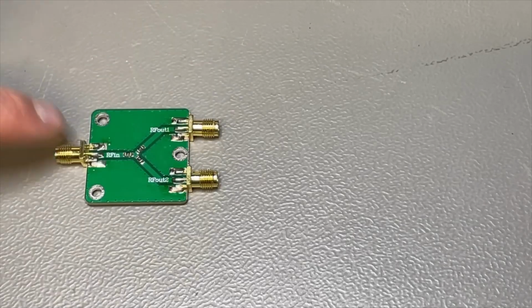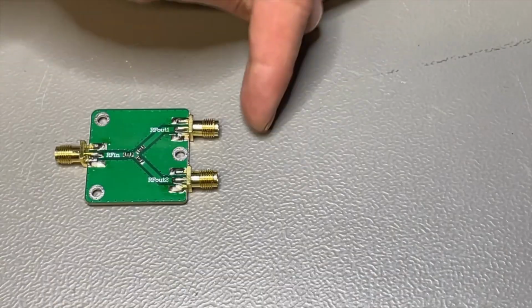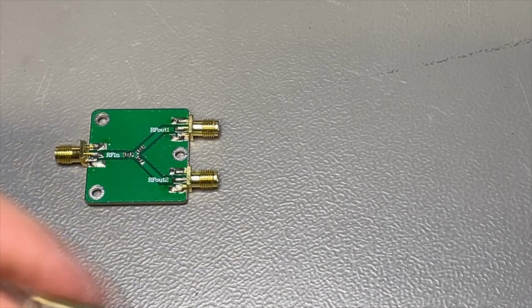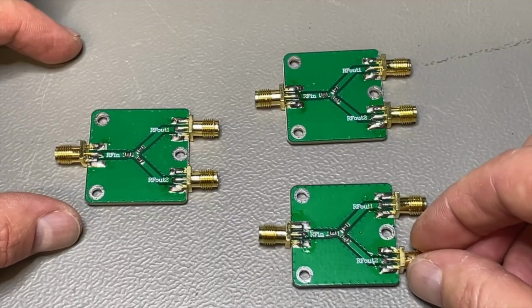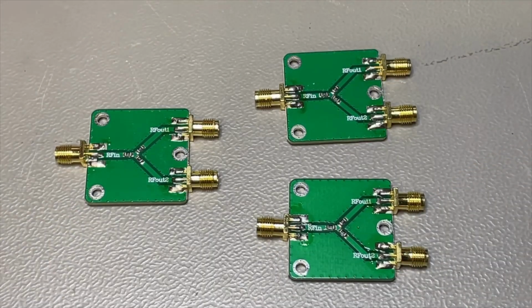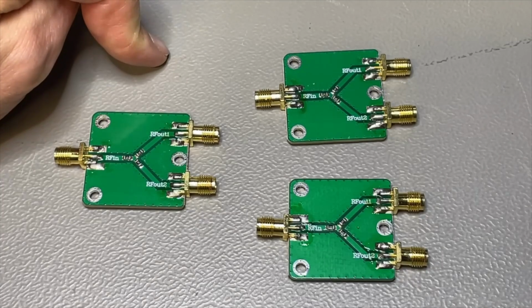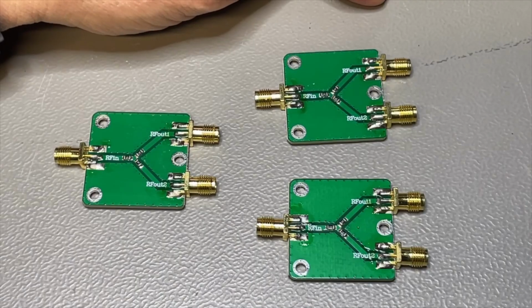So between all the connections you have like 32 ohms. And then I don't know how they come with the parallel 25 and then somehow it becomes 50 again, but it is probably a trick they do. If you want 4, you just add 2 more here and then you have 4. These are the cheapest. You really pay a few dollars for this because it is only resistors, and the connectors are probably the most expensive part. And because it is resistive, it works already starting from DC all the way up to a few gigahertz.